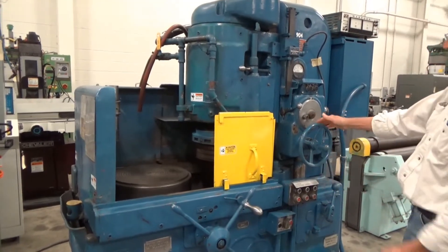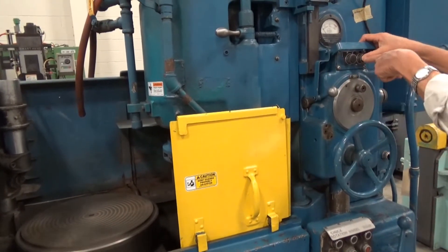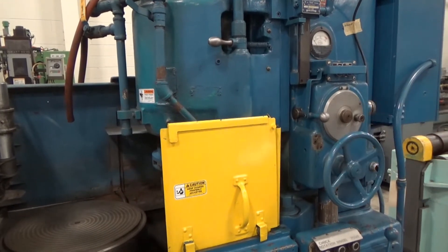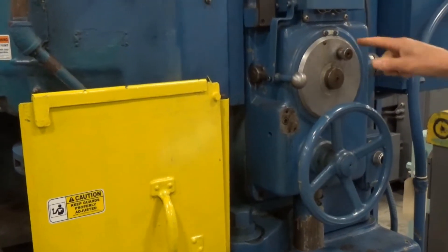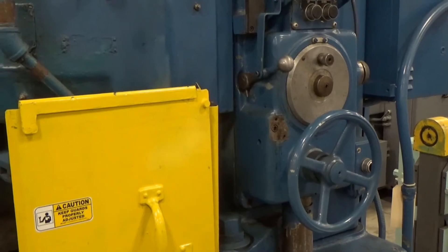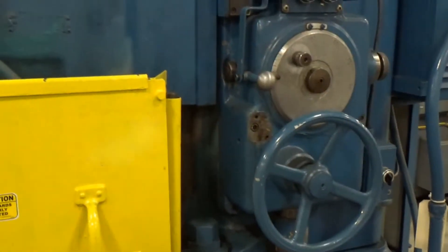With 24, we might as well check the feed out right away off the dial. We've got the handle that comes in and locks us from Rapid. We bring the feed in with ratchet and pawl. And we kind of put this wherever we want — put our zero right there. Should trip out. There's zero. And then trying a couple different ranges. We got room to come down. We feed in.